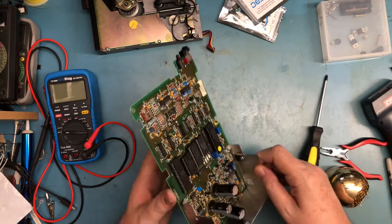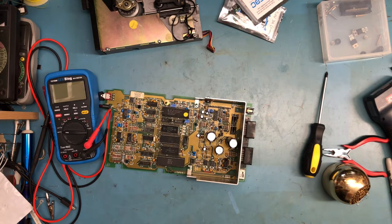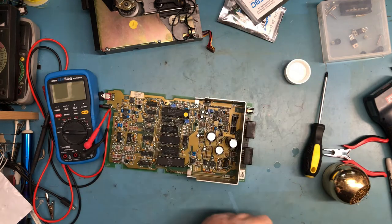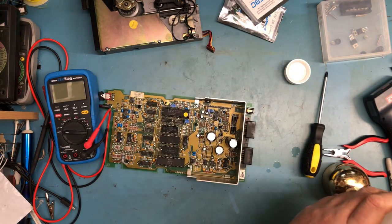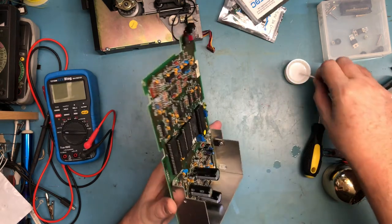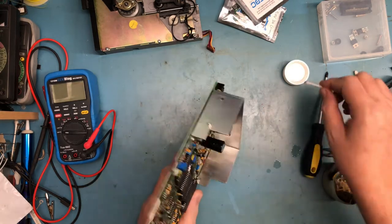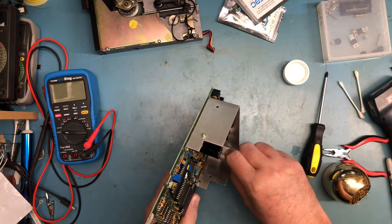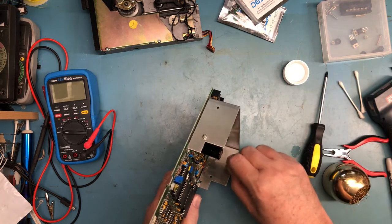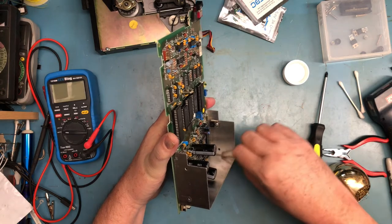We're gonna get a bit of alcohol. We're gonna clean the old dead heat sink compound out of the inside of here, hopefully. I don't think I have any Q-tips left laying in here. Yeah, I do. There's a few Q-tips hiding over here. Just because I can get rid of it, so why wouldn't I? And the heatsink compound is effectively removed.